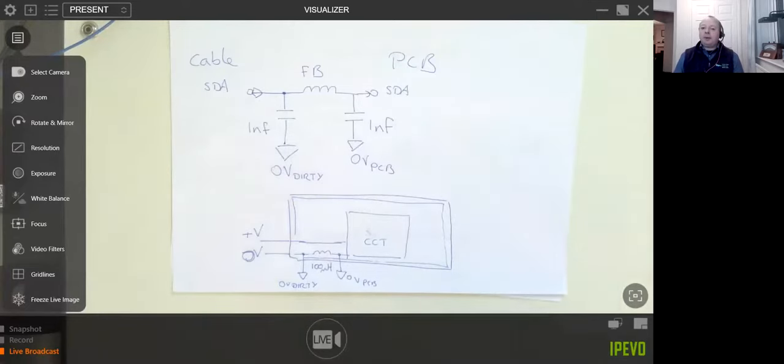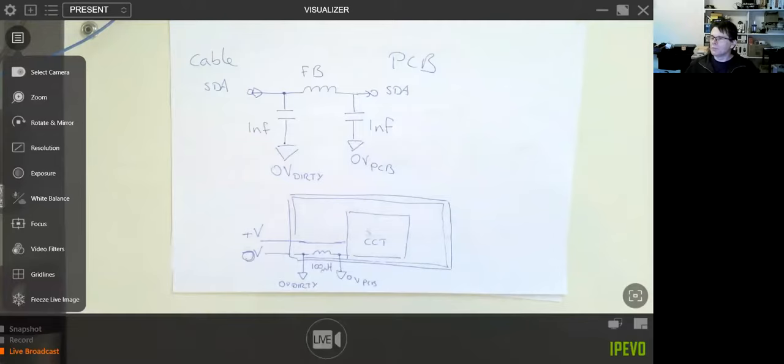You mentioned a standard pinout. That's just what they've chosen, of course, isn't it? There is no defined pinout standard at all. Exactly. It's used by Grove, Qwiic, and STEMMA, which are different names they've given to their choice of connectors, but they've all got the same pinout, so it's easy to make adapters and the like.